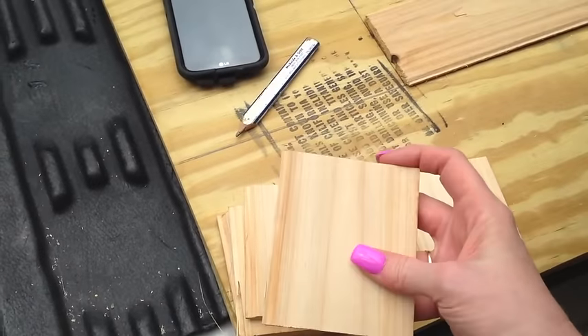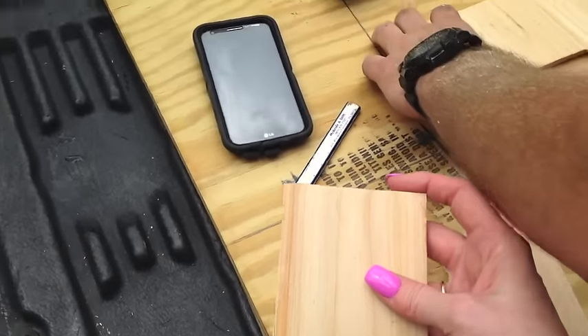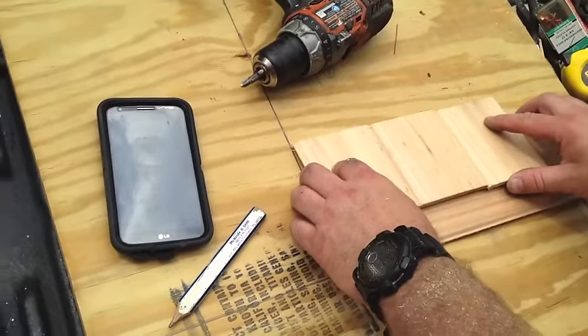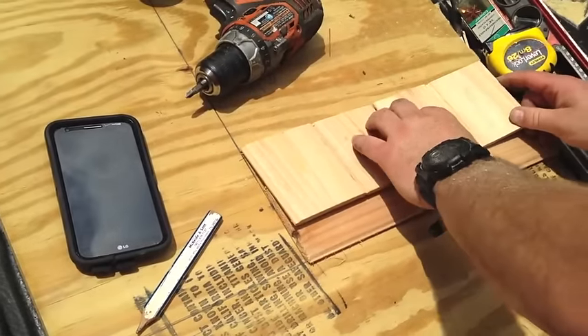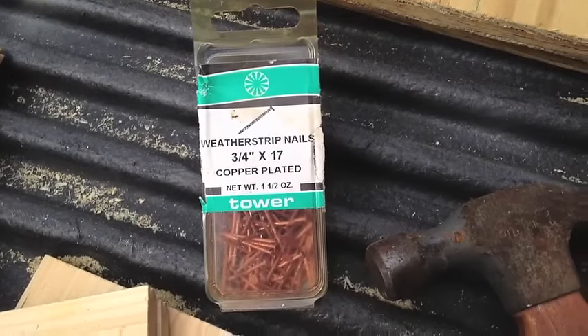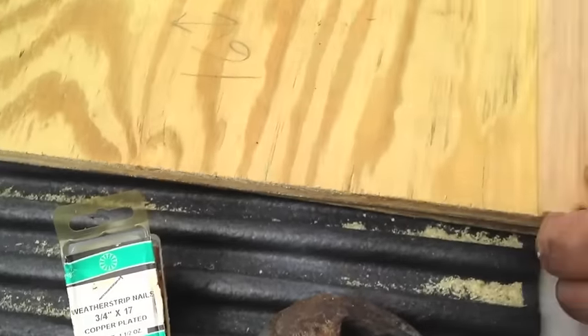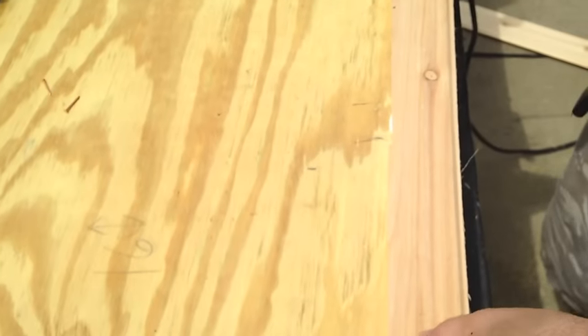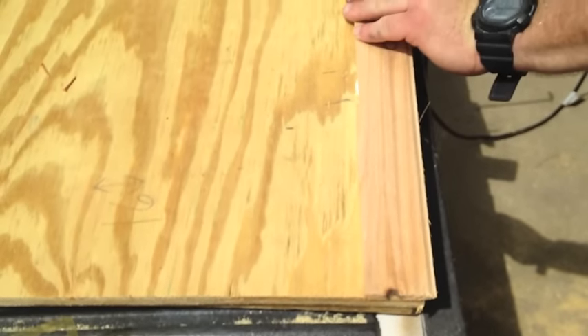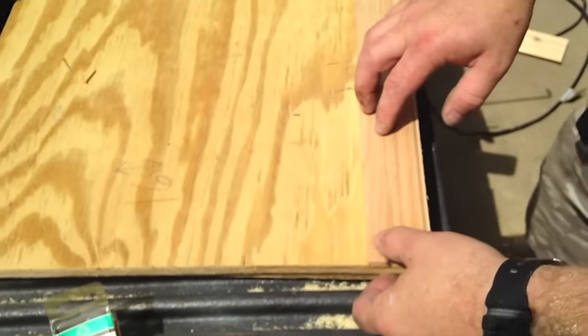The pieces he's cutting are about four inches long and they're actually tongue and groove. He's just kind of playing around with it now. He's going to get all those cut for both sides of the roof. He's using nails and then he put a little smear of liquid nails, with a small starter strip to offset the gap with the first strip of cedar shakes.